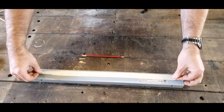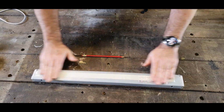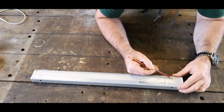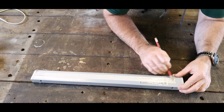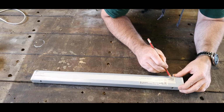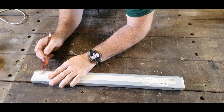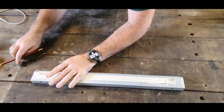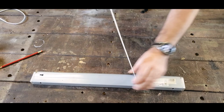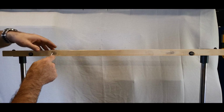So you just draw it across the holes that you're looking to template. Wow, just enough. Grab a graphite pencil, and all you need to do is just gently color over where the pinholes are. If you've done it right, the edge of your pencil will bring out the edges of the pinholes. Once you've done that, simply take it off and attach it to the piece of material that you want it to work on.